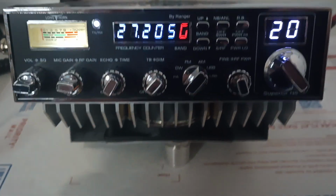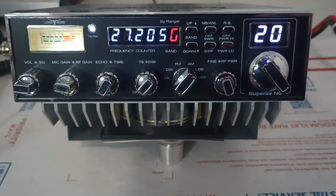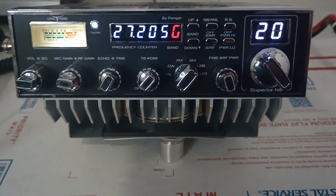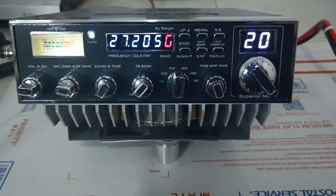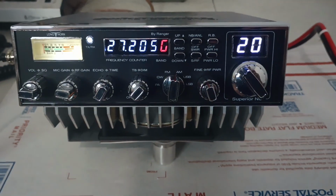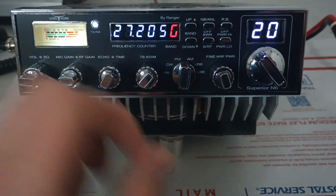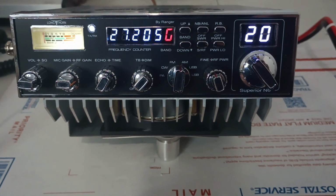Obviously great radios. If you do want to run an amp with one of these, like I talked about before, you're probably going to want to run a 16 pill 2879C or a 24 pill 2879 standard. That's if you have it tuned and everything. Now, if you like your radio stock, you can probably get by with something smaller. But if you want your radio tuned, doing its optimal performance, that's about the size of amp you'll need with it.